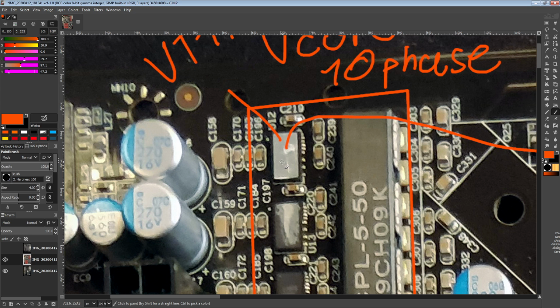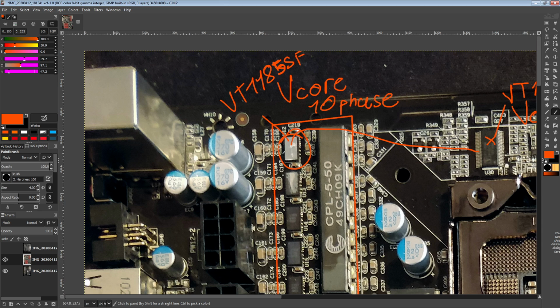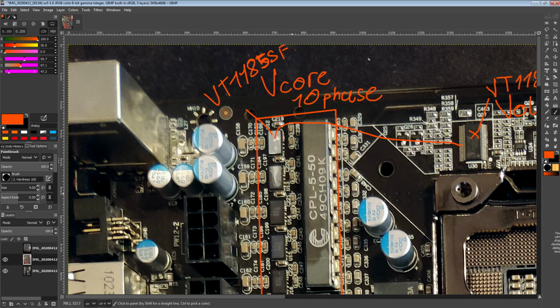And I keep calling these power stages, even though these have way too much intelligence in them to be considered power stages. They do not work like power stages at all, but I'm just too used to calling them that. They look like freaking 3553s, okay? I can't help myself. Or, well, they're rectangular like 3553s. 3553s have a regular epoxy package. But anyway, these are bare silicon, which is done for better thermal performance, which is pretty neat.